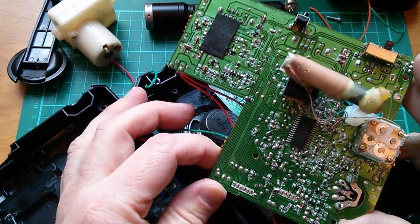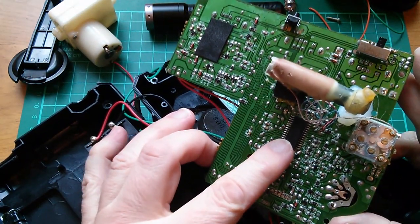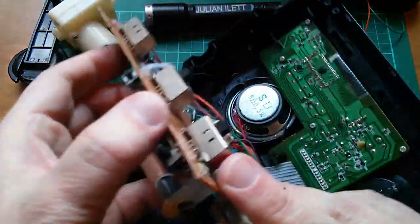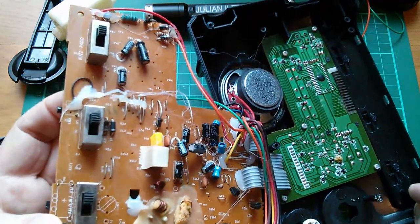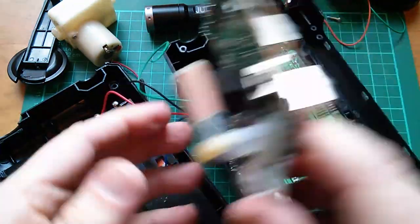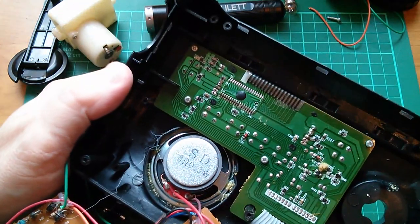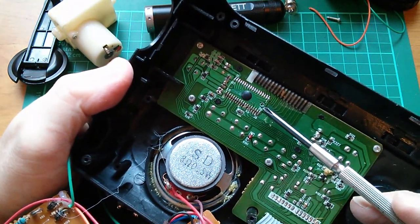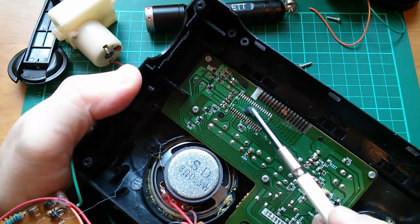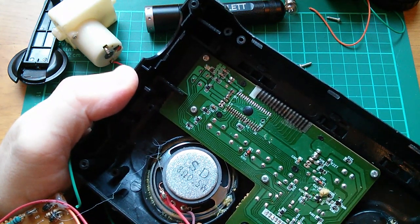This board's got two really different sides to it. You've got a surface mount integrated circuit here — the AM/FM radio chip — and lots of surface mount components with quite fine tracking on this side. On the other side it looks like early 1970s radio technology. It's just bizarre — it's like a complete Jekyll and Hyde, this thing. Now this board here is interesting. It's got a little PCB soldered down onto the main PCB — this is presumably the LCD driver with a little blobbed chip on its own PCB, soldered down onto the other PCB. That's rather odd.